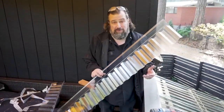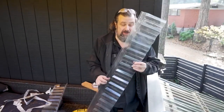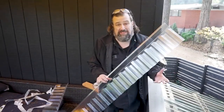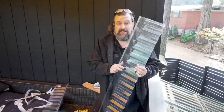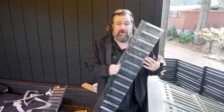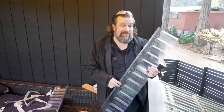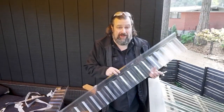The way we're going to seal this up at the very top, where it meets the side of this railing, is with this clear flashing. It's an acrylic material, same as the panels. This actually goes up against the top and overlays it, so when the rain comes down it'll direct down and go over the top of the roof — not under it — which means it's not going to be dripping down underneath. Let's get this on there and screw it down like the rest of the panels.